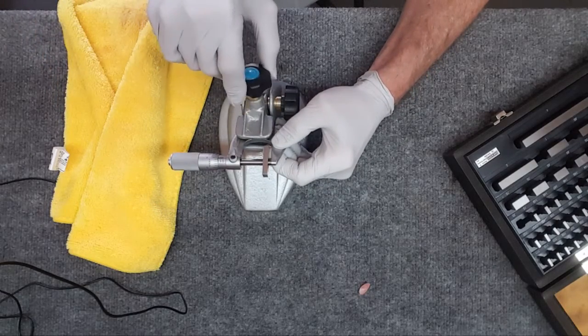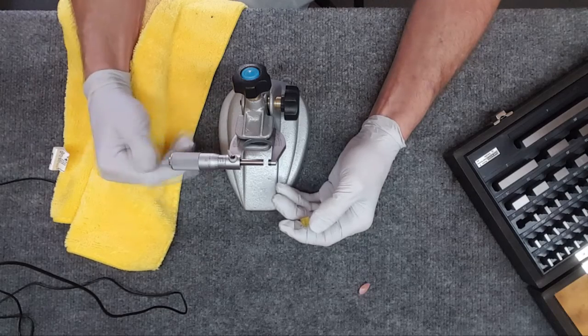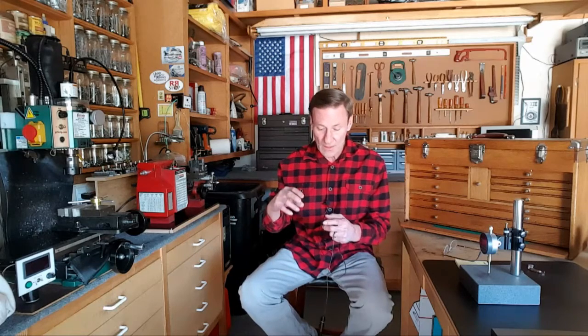That's how you do it. I haven't really played with it to see if you can detect half a tenth. This mic reads to a tenth of a thousandth — you just have to pay attention to the other numbers. Once you know the size of the block is truly a hundred thousandths, you put the block back and spin it. If it's not on zero, spin it around to the vernier section — the only line that lines up is the zero, which means the block really is basically a hundred thousandths. So it was operator trouble.